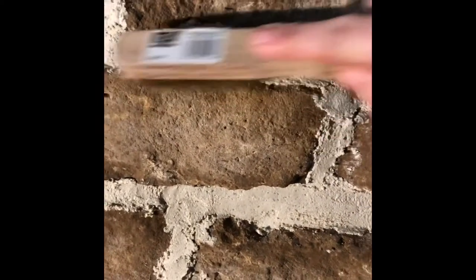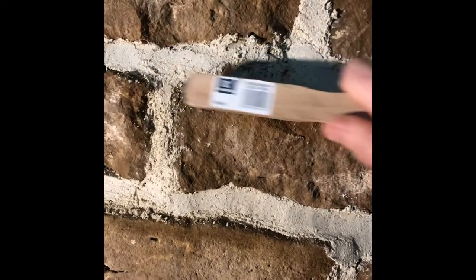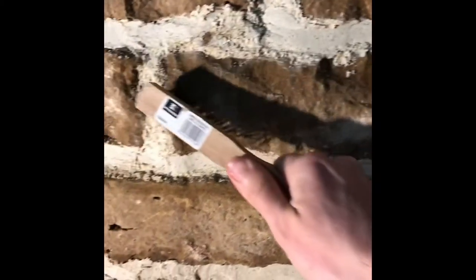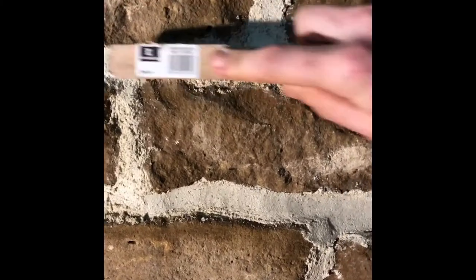All we're doing is taking off all the rough bits which have gone onto the stone — for example bits like this here — just want to take off anything that's gone onto the stone while still leaving behind as much as possible of the actual joint within the stones. What you end up with is the maximum amount of the stone on show, which is what I want because I'm doing this to keep the main feature of the stone. The alternative quicker method of covering the whole stone in lime and using a stiff brush to reveal the stone gives a smooth finish but you hardly see the stone and you end up with a big pile of material on the floor.